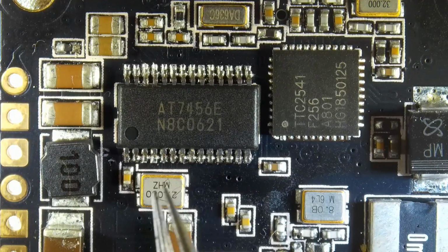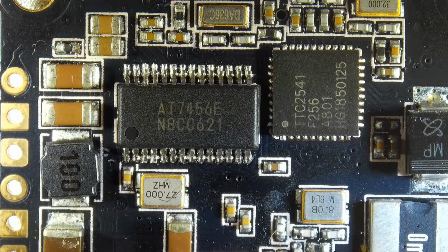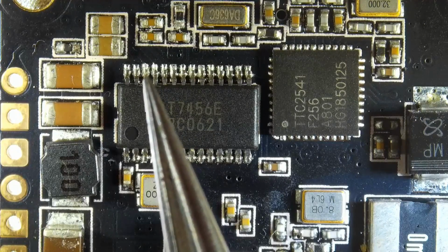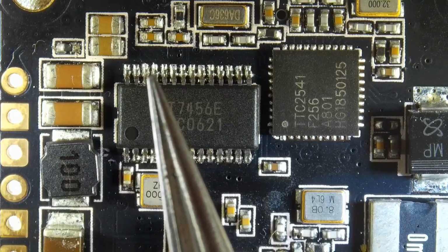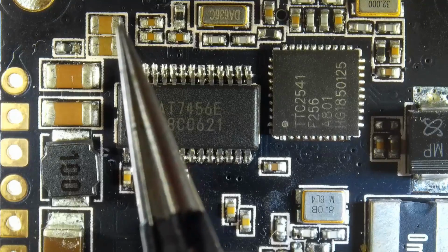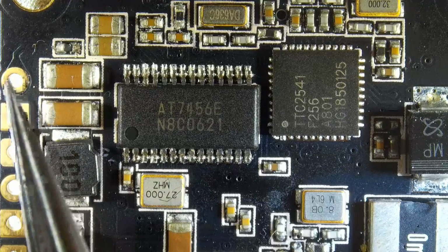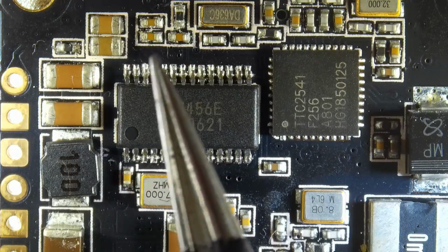Now let's take a look at this. Pin 26 is the video output, and pin 26 would be all the way up here, this third one right there. This one would usually be connected to a capacitor and then a 75 ohm resistor to the output, but it depends. Currently the video out is right here. This is the resistor that's connected straight to the video out pin, and it's going through this cap right there, probably through some other things.